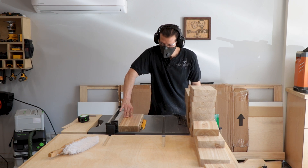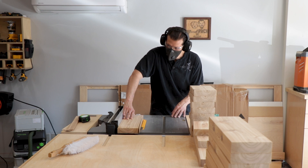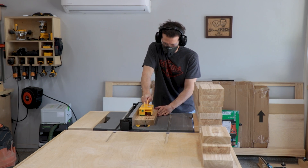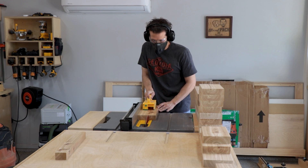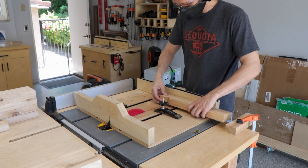For these ones I'm starting by just ripping off a little bit of the edge because they come with a small round over on the edges, but I need square pieces for now as I'm joining different ones together so I can have good seamless joints. Then we'll re-put those round overs on the pieces that we need later.